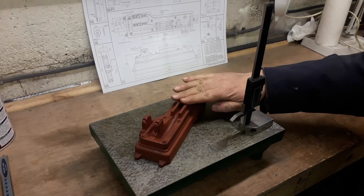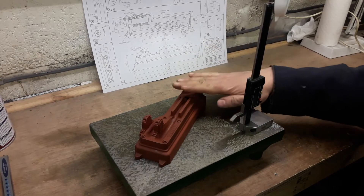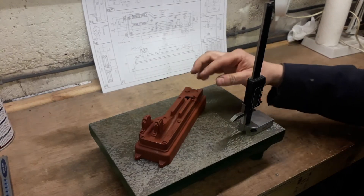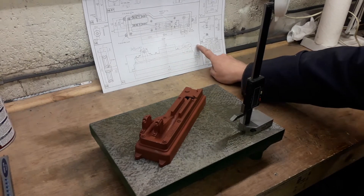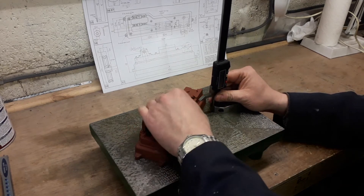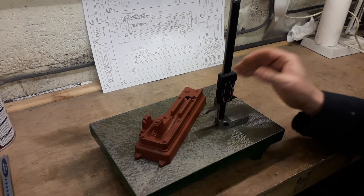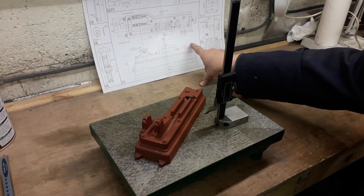That measurement is very critical — it's to do with the slide rails. The other important one is marking up the center where the main shaft is going to go through with the pulley on. So the first measurement from your face here is inch and a half, which I've already set. I'm just marking the inch-and-a-half marks on there — these will just be a guide. When we come to machine, the DRO will sort that for us, so what we need now is that 0.3281.